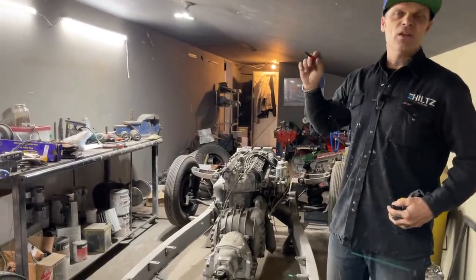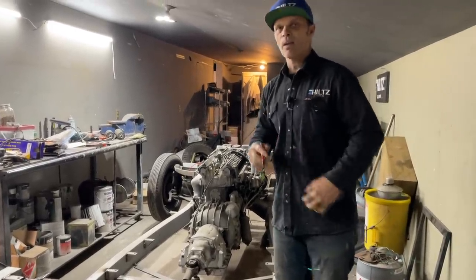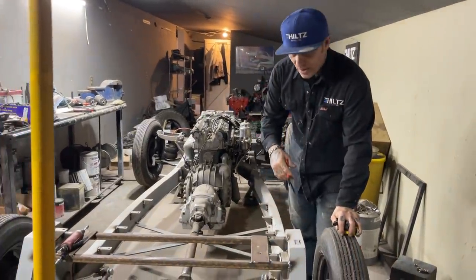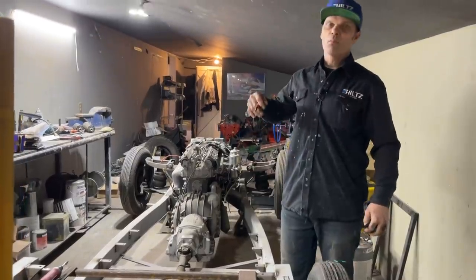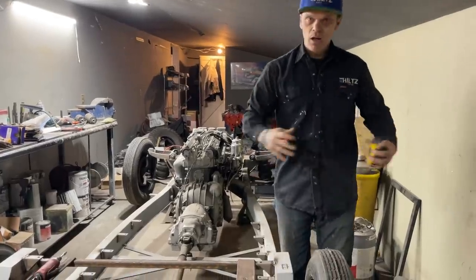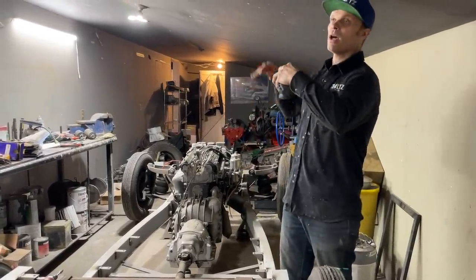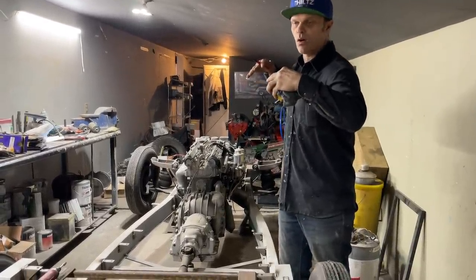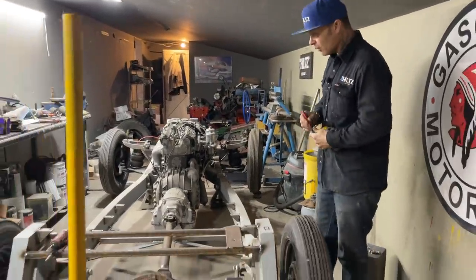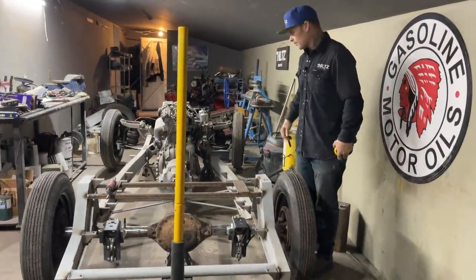You would have to be able to pull that apart to wreck that. If I hooked the Blazer up, put a piece of chain in that, hooked another Blazer up and put a piece of chain in it, I bet you could not pull that pipe apart. I bet you could not. So you have to realize, as I've done that, I've put probably more integrity into the chassis than it already had. The walls cannot come out so it can crush. To pull it apart, you'd have to pull the pipe apart to pull the wall of the frame apart. I think about stuff like that when I'm building things. I don't want to build things unsafe. I mean, let's face it.